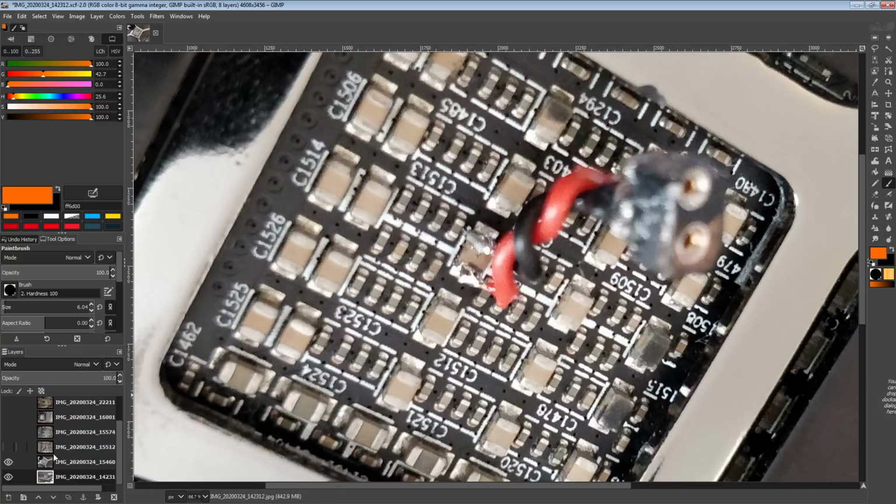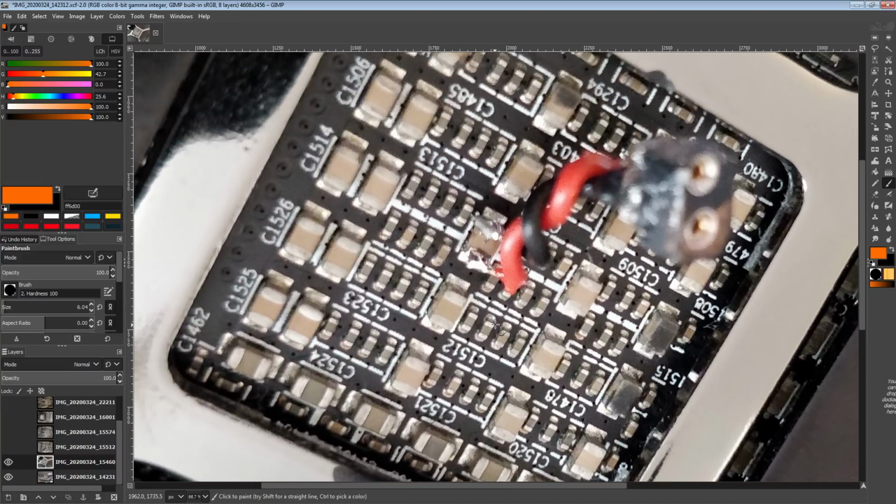The thing is, I could go for a shorter attachment method. The problem with a shorter attachment method is that there's a good chance that the probe hanging off of the card will damage the multilayer ceramic capacitor, and I don't really want to break the capacitor. There's not really dedicated convenient probe points that I could use on the card. So these little extension wires are a convenience thing in a way, but I don't really want to run the risk of breaking a capacitor. It's not fun to deal with.